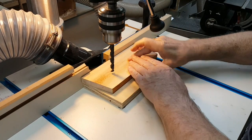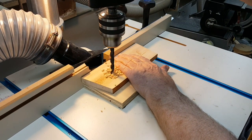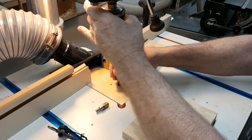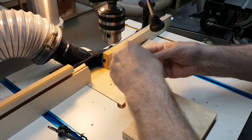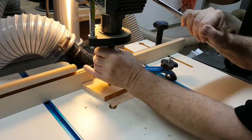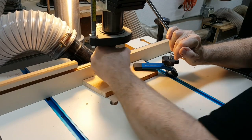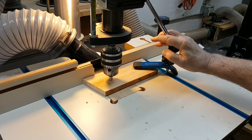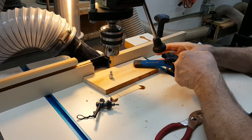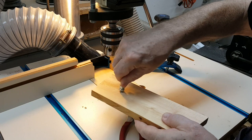You can do this with a wrench, but keeping the insert perfectly straight is very difficult. So a common way of installing it is to cut the hex head off the bolt, put it in your drill press chuck, and turn the spindle by hand as you apply downward pressure. Here you can see that the drill press is keeping it perpendicular to the wood as I screw it in.